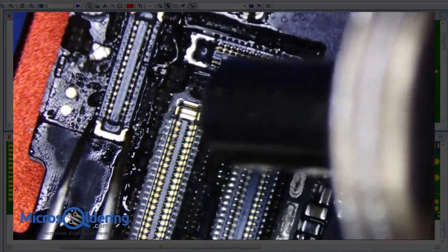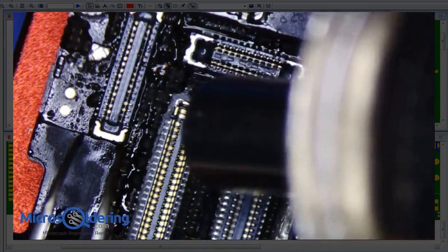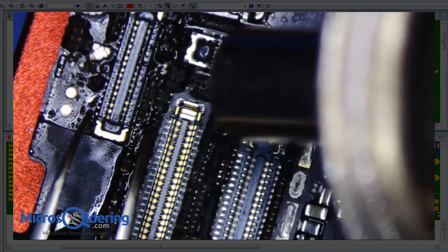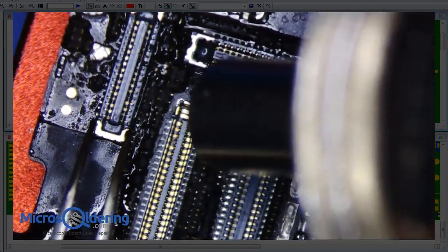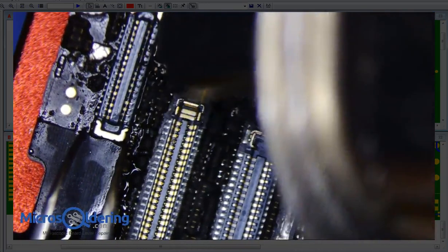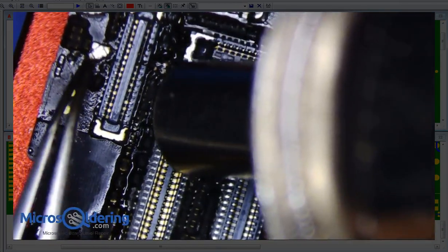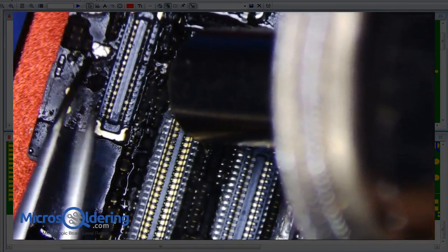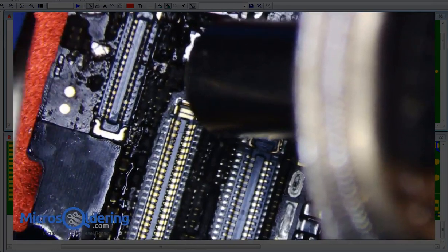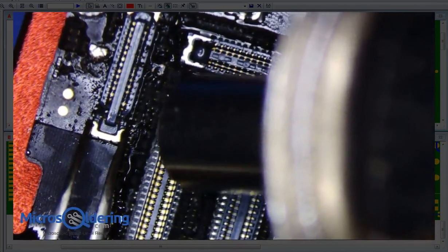This thing is not heating very well. I was at the same temperature earlier, and it was going nice, and now it's just not even melting the solder. This is a quick 861 DW. That's the bottom part of the LDO, so that shouldn't even be there anymore. I guess I might just have to take the heat up a notch.